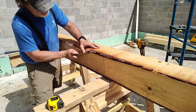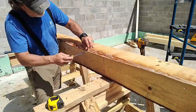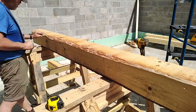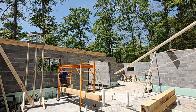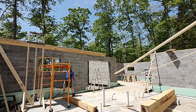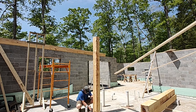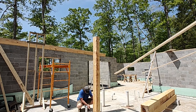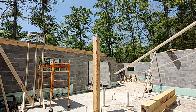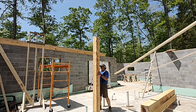Here I'm chiseling off some of the bark — this is a smaller tree and this eight-by-eight ended up catching a little bit of sapwood and just a corner bit of bark, so I'm chiseling it off. This post is going to be hidden in a wall so I'm not terribly concerned about what it looks like, and it also gives me the opportunity to practice this process on posts that won't be seen. The post is in place now, the pins are in — I didn't show screwing the plate into the concrete but that was a pretty simple process. I'll do this again for one more post in this section of the house and then we'll be ready to lay the subfloor.